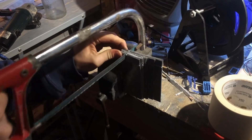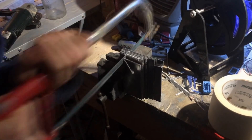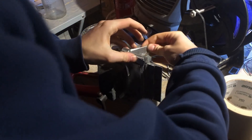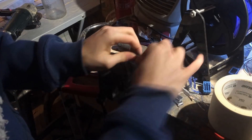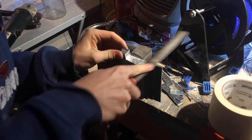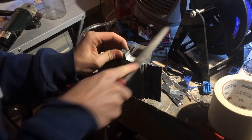So now I'm just ensuring that the cuts join together so that the excess material is easily removed, because they didn't quite join up. Now the extra bit can be removed, leaving us with our nice tabs on the top of each of the plates. Then I used a file to smooth out the cuts and remove the rough edges on the sides of the plates. This makes them a lot easier to work with and also makes them look a lot nicer.